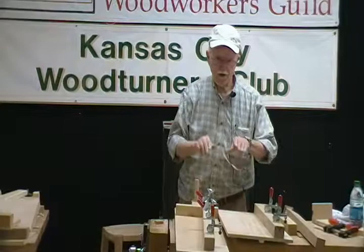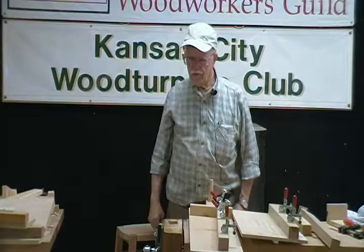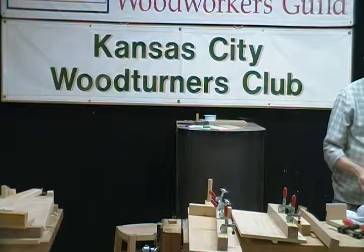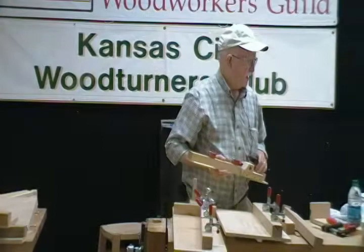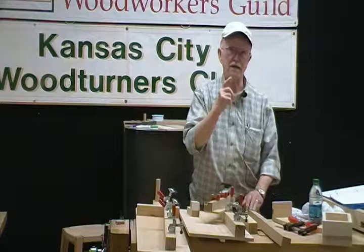On a drill, you can position in two directions and you've got a depth dimension. You can set your drill depth, and on a drill press you have a fence that locates you front-to-back from the drill center, and a stop block moves you side to side. You want clamps on the drill for safety — it is very important that you clamp stuff down on the drill press.